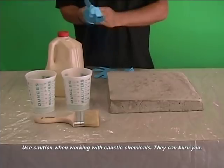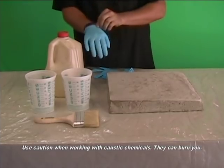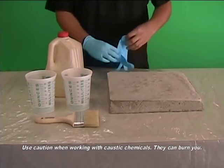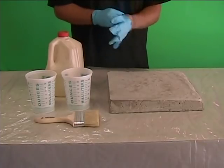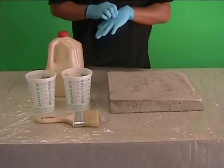This step is very important for new concrete. Older concrete may have seen the calcium sulfate slough off over time, but this does not mean there is not calcium on the surface of the concrete or stonework. A pond that has been run with water and no protective coating will almost always have some sort of mineral buildup that occurs over time.